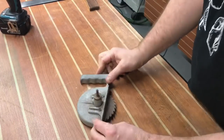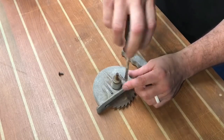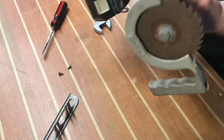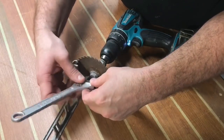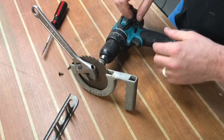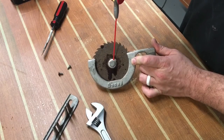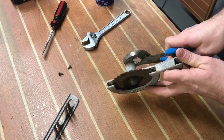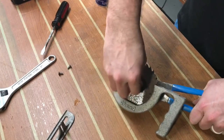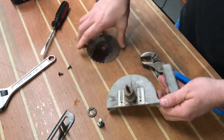As you can see, there is not much to this — it's only a few parts. I'm taking a flathead screwdriver and undoing the actual bed. These screws hold it in place and also provide depth adjustment. I'm realizing that chucking this up isn't quite strong enough to loosen this bolt, so I'll go to the trusty WD-40, put some on here, wait about five minutes, then take a pair of channel locks and grab one end and use my adjustable wrench — and yep, that frees it right up. And that is the deconstruction complete.